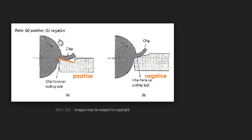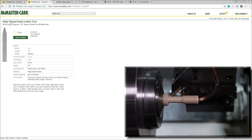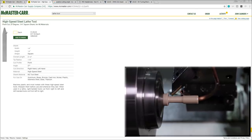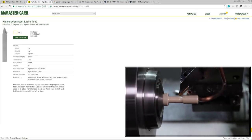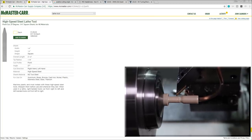How do you go about doing that? Pick up a high-speed steel tool. If you've got some blanks on hand you could grind one, buy one, or meet it in the middle. I would probably pick up a neutral — not a right- or left-handed tool, but a neutral high-speed steel tool already formed from McMaster-Carr. Then I would add some positive rake or back relief to it as needed based on the material. You could dress this up with a diamond file, and that's important because high-speed steel generally lasts forever in plastics. This part does have a glass impregnation to it, which will dull your tools, so dress them up with a diamond file or a stone as needed.